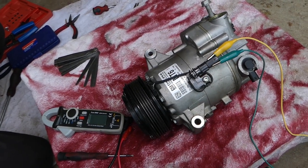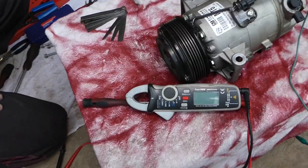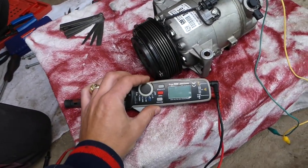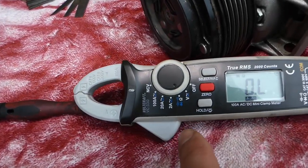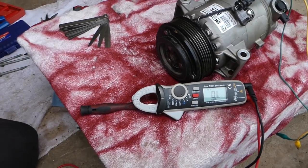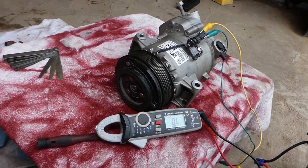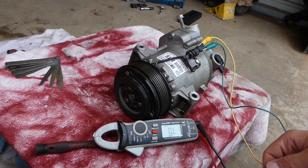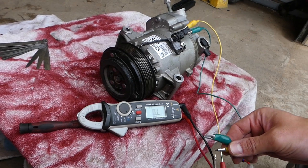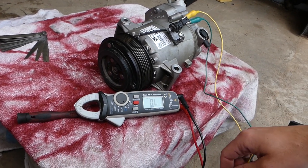What is the safe way? All you need is an ohm meter — any ohm meter will work. We'll set it to ohms and connect the same wires to the meter. That way you cannot burn anything. We're just checking the resistance of the coil, and even if you put the leads the wrong way you still won't burn it and you'll still get a resistance reading.